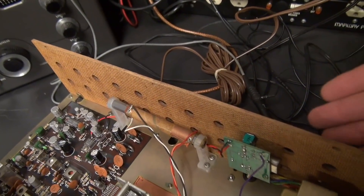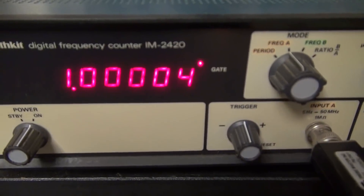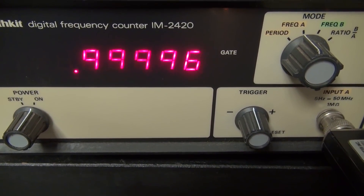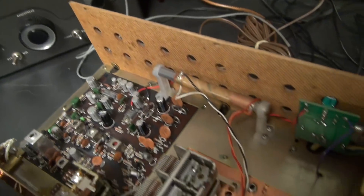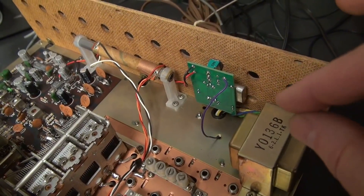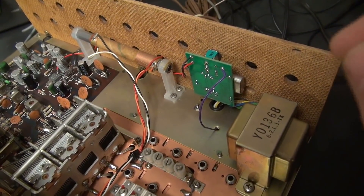For the fun of it, I've hooked up my Heathkit frequency counter. I'm going to flip this on — I'm monitoring right across the antenna jack going into the back of the radio. And there is our 1 megahertz signal. Off. On. Pretty darn close to 1 megahertz. This circuit is very basic, and what's really nice about it is it operates at the resonant frequency of that crystal — no little variable caps to tune it in. It's perfect right off the bat.